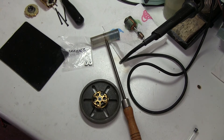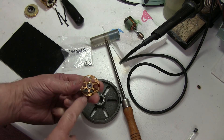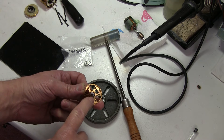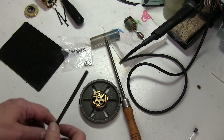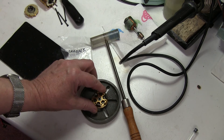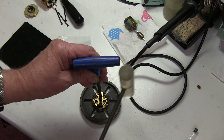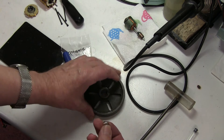How to replace the bearing in the motor without damaging it - you just have to be careful. The bearings in this end are the easy ones to get out. Sometimes they are loose and just fall out; sometimes they are too tight, which is not good as it squeezes the bearing. These days the manufacturing tolerance means they are normally a good fit. To get it out - well, as you are going to throw it away it doesn't matter too much, but you need some way of pushing it out. I select something that just fits over the bearing without fouling on the ends, put it over something with a hole in it, and just knock it out with a hammer. Like that - you can throw that away.